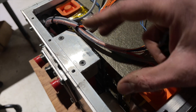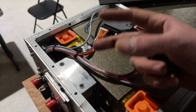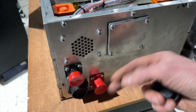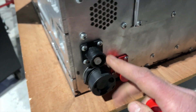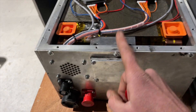A contactor is basically a big relay — a big on/off switch. There's nothing coming out of the positive terminal until it gets a signal to turn on and allow current through. So even if you jammed something into these connectors, there is no live current. You can also see a fuse down the bottom — each positive output is always fused on both packs.